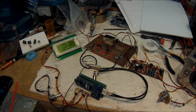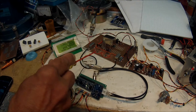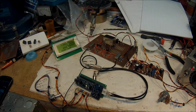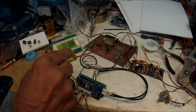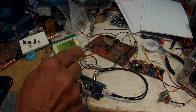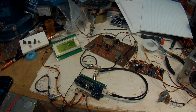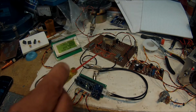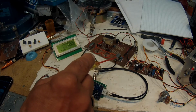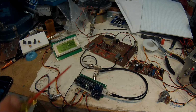double balanced mixer. There's two bilateral stages here, amplifier stages, comprised of a 2N3904 and a 2N3906, and these are surface mount, so you can hardly see what's here. A couple of coils going into a homebrew filter. By the way, this is a test bed that I use for crystal filters. The product detector is another SBL1, and it gets dumped right into the audio amplifier.